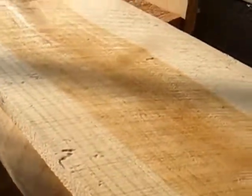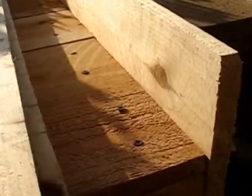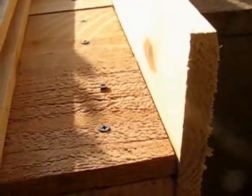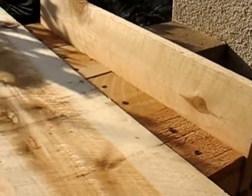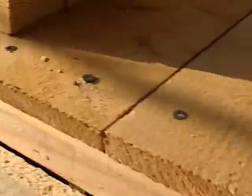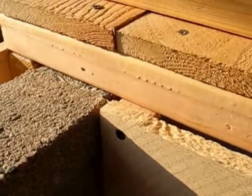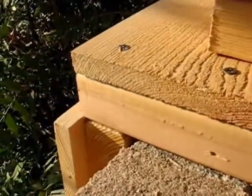These are not just 48 inches but 48 plus 5/8 on each side to account for the 5/8 for the side pieces. These are the side pieces. I've mounted one more up there, so there's 2 of them on the right and there's only the one for the skirt on the left. So I've got 3 pieces remaining to go up. Also, I should note that instead of just simply cutting these 22 inches to match the top, because I have the brick wall there, I have to actually cut it short by a little bit. I'm probably going to have to put a scrap in over there, but I can do that later.